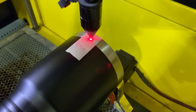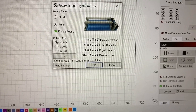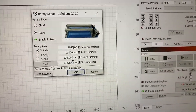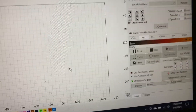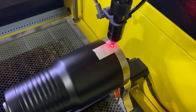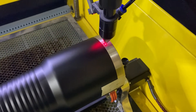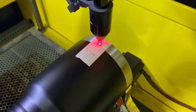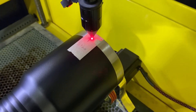Since it rotated just a little bit too far, I'm going to dial the steps down by 10 — so let's do 2040 — and say okay. Now we're going to test it one more time and see where we're at. That is almost dead on. I could probably drop just a little bit more, but for this demonstration I think that's good enough.